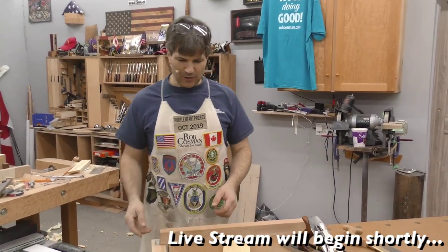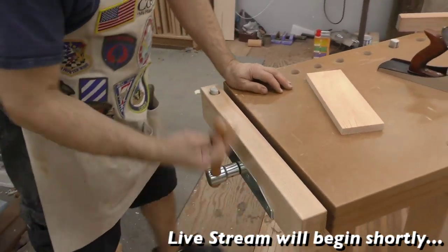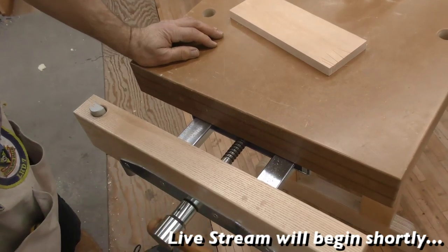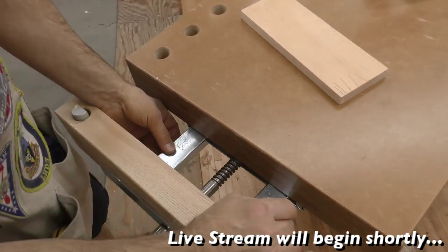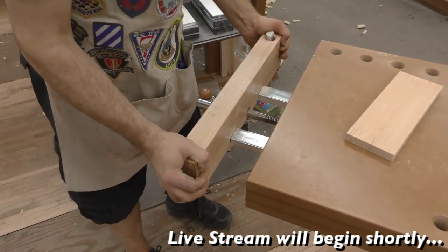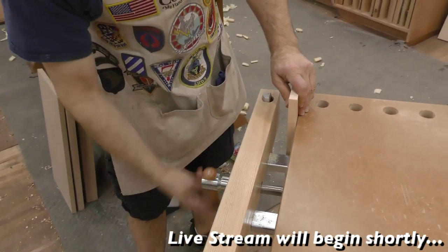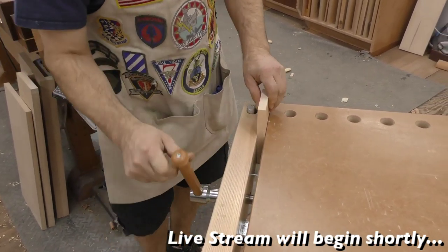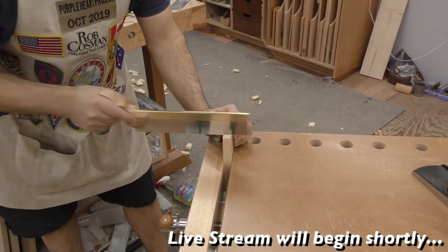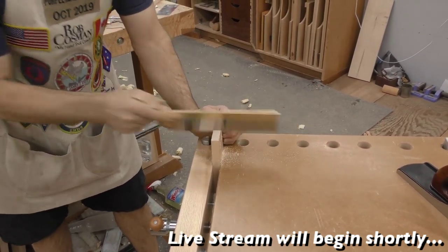Next thing, and perhaps one of the more important, is the vise. Now, what we utilize is a Schoberg vise, and I'll just unwind this and show you the biggest feature. Instead of having round tubes, they use 2 rectangular pieces. That allows for some bolts underneath here to take any of the end of the rack out so it does not slide side to side. That means when you're securing a piece of wood that you're going to cut dovetails in or whatever, it clamps and holds it tight all the way across the width, so when you're sawing, you don't get any irritating vibration that makes it difficult to be accurate.